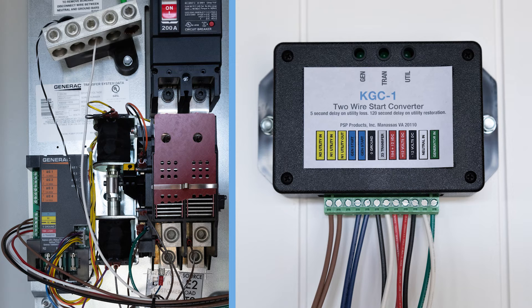If the battery source is good, verify if the generator starts without the KGC-1. With the generator in automatic, remove the two gen start wires and short them together. Does the generator start? If not, troubleshoot the generator start circuit, as you may have the wrong wires. If the ATS does not transfer after the generator has started, or if the generator LED on the KGC is not on after the generator has started, verify 120-volt AC power on generator in and verify the neutral connection is good. If the limit switch referred to on the KGC install sheet is not available, you can install an inline fuse and connect generator in to terminal E1 in the ATS. This is where your generator feed connects in the transfer switch.